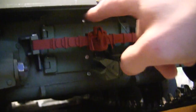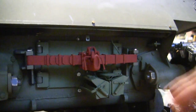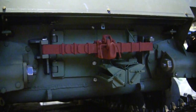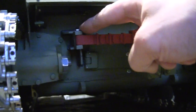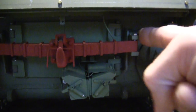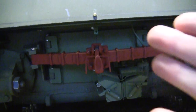If anyone is wondering how to get access to the engine compartment, this is a legitimate concern. With the location of the tow hitch, access to the door is going to be very limited. The designers knew this and designed the whole unit to swing out of the way. There are two fasteners on either side of the mounts, and by simply pulling the pins out, this component is removable, which then allows the crew access to get to the engine.